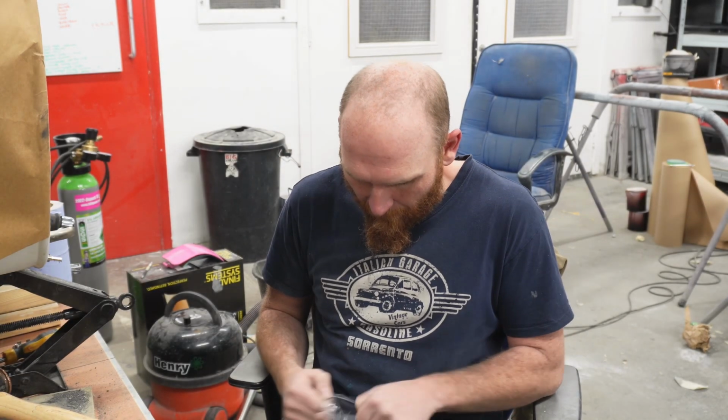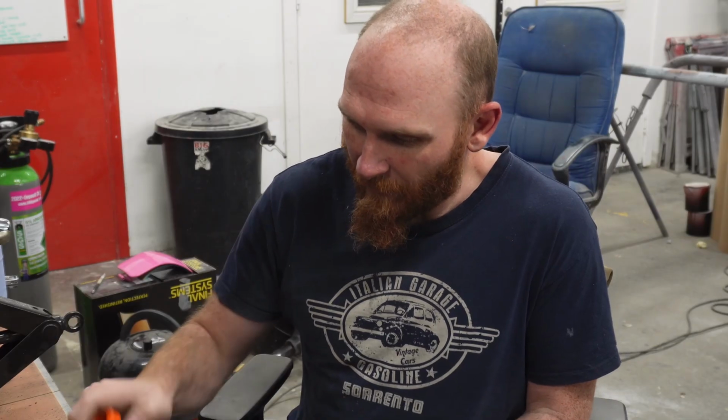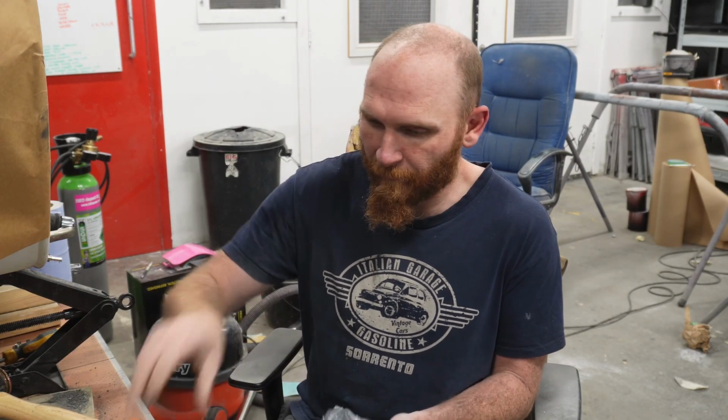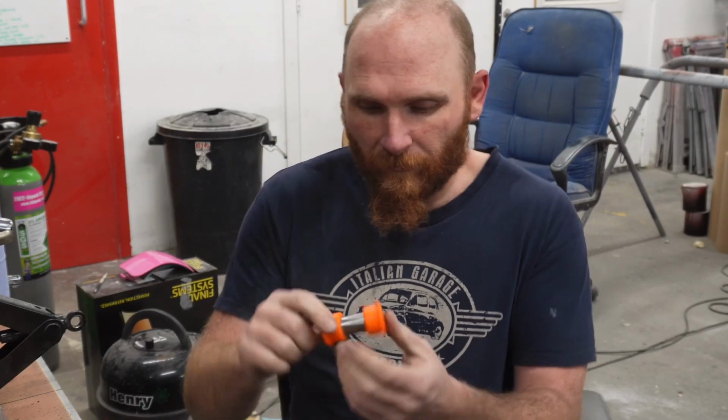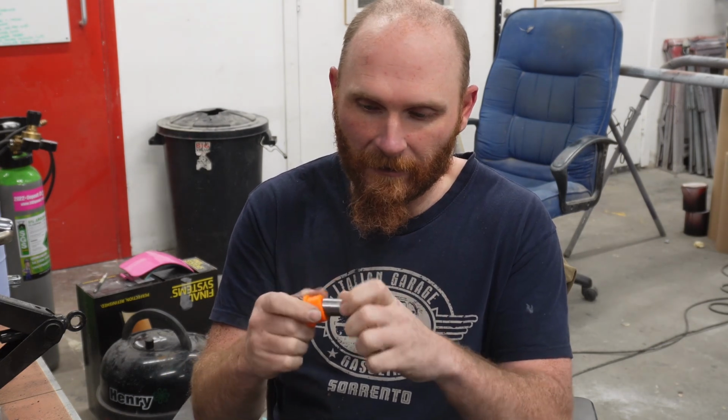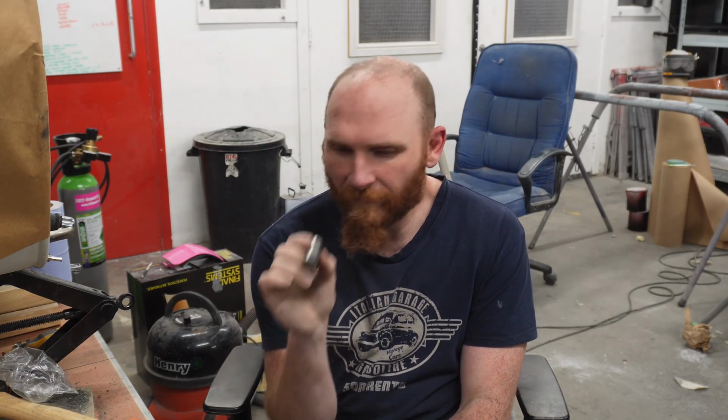I've actually ordered the shocks for it. They haven't turned up yet because they're coming from Germany, and I've ordered some bushes for this bottom pivot part for the front swing arm. Polyurethane bushes, so yeah, 3 pieces. You got the 2 poly bits and then a steel insert in the middle. So now I need a piece of bar, the same as that, but longer.